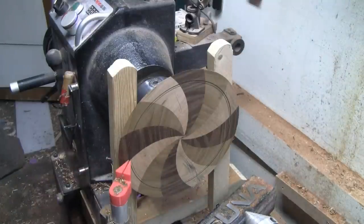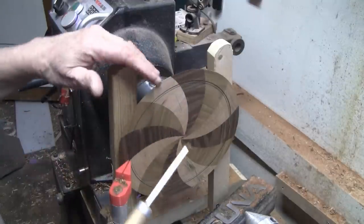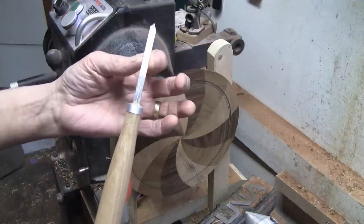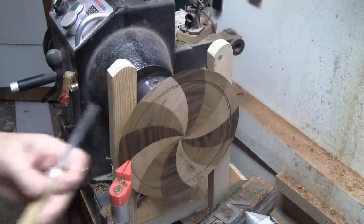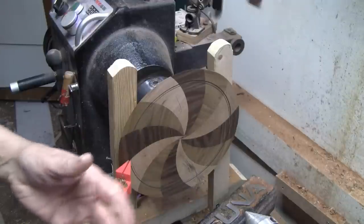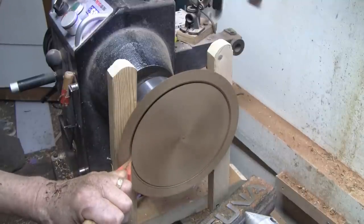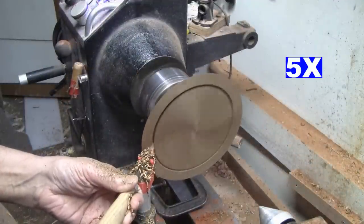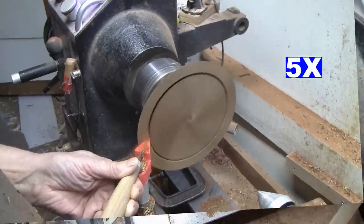I'm going to cut another ring, and I usually touch up the tool in between rings because it can get kind of hot going in there on an angle. I also feel that a quarter inch is about as large as I want to go on the height of the parting tool, because when you're cutting on an angle the top and bottom edge could easily hit on a wider one and it'll get really hot and bind. It looked like I had enough room to cut one more ring, so I went ahead and did it—it got really close to the base and turned out just fine.